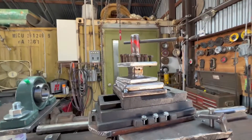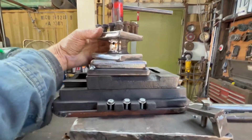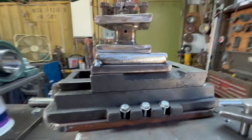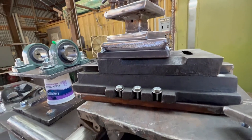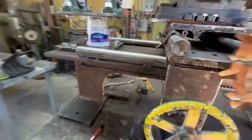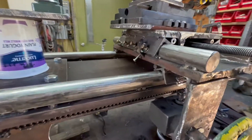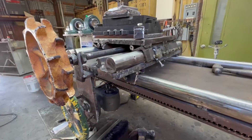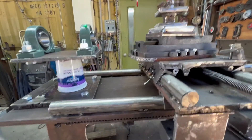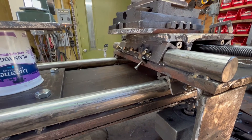This morning we now have a tool post — I don't have any tools but we have a tool post and it works pretty good. I can loosen it, swivel it, get it where I want it, and tighten it up. I've also welded two little clips — one here and one over here — to lock the carriage. They'll keep the carriage from vibrating and changing location if you're turning a long cylinder. I'll replace these little bolts with something you don't need a tool to operate.